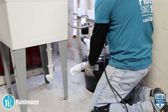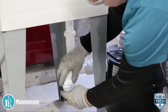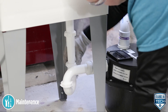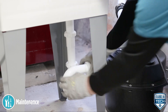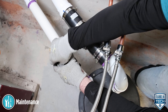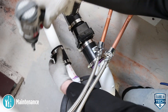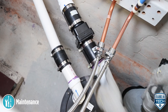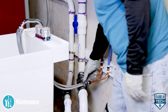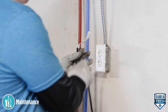Finally, reinstall the basin to the system plumbing. Remove any plugs and open all valves as necessary to bring the system back into use. When complete, plug in the pump and confirm proper operation and that no leaks are present.